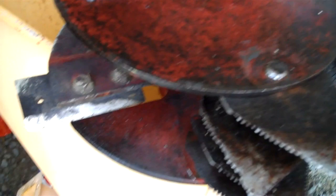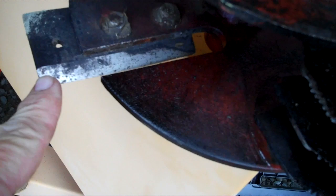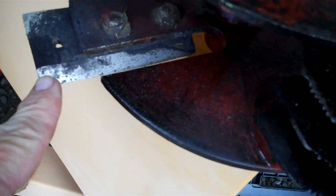Now's a good time — if you haven't changed these blades here, the ones that do the branch cutting, these are for leaves and small branches. The big hole is for big long branches. Since you already have it off, just go ahead and undo the two nuts, turn it over, put it back on, and you're done.